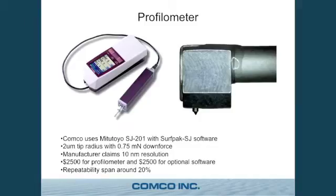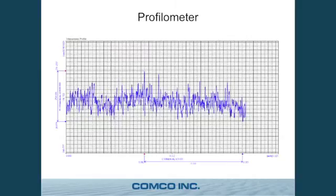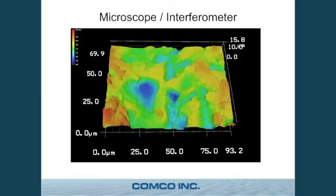A profilometer is certainly the most commonly used tool. It drags a stylus inside an arm over a surface, and the tiny needle on the right picture moves up and down with respect to that arm as it's drawn across, profiling the surface of the part. You end up with this scratchy-looking line, and the profilometer will give you numerical outputs. A microscope or interferometer allows you to do a 2D or 3D version — taking an area instead of just a straight line to analyze surface characteristics. These have a 3D output that's analyzable the same way as a 2D output.